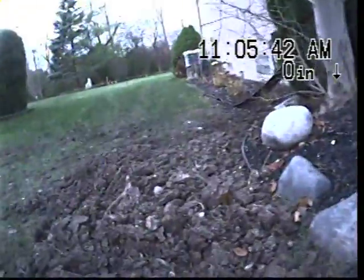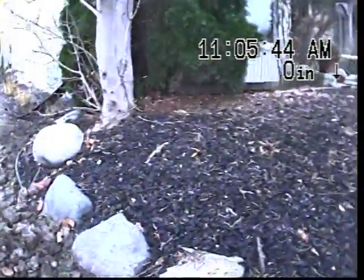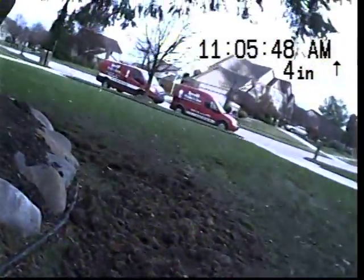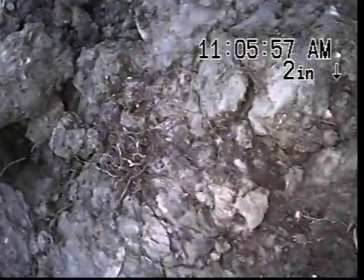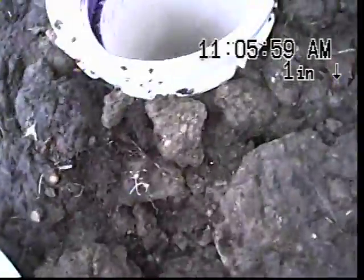As you can see, we dug up towards the house here by a tree and some landscaping, and we dug downstream past the landscaping to tie back in. The discharge is 4-inch S&D. We did use 4-inch Schedule 40 PVC for our repair. We did put a two-way T out here.